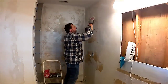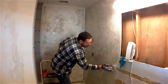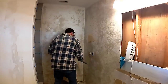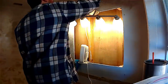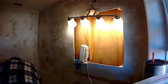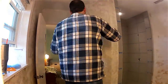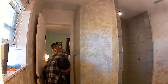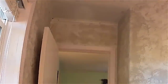Now it comes time for texture. I'm using a sponge technique where I apply a small amount of drywall mud sponged all over the wall, then I take my large knife and knock down the texture just really lightly to feather it. It provides a really nice knock-down finish on the wall and covers a multitude of sins with your drywall. It's a really basic texture — you can use spray texture if you want, but this is more affordable; it just takes a little more time. You dab it on close up near the door, then come back and knock it down.